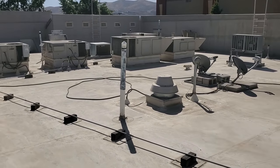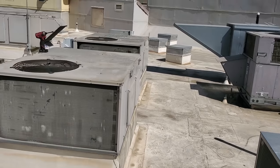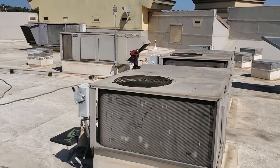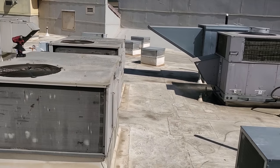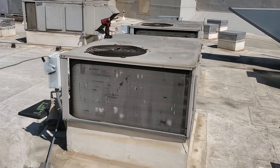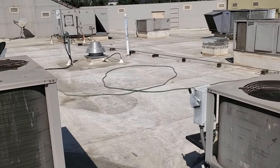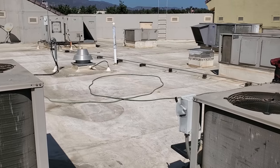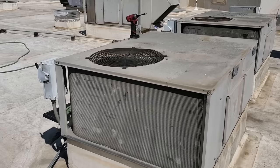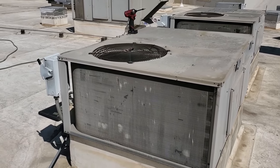I've gone to every AC and verified that the thermostats turn on every single AC, even the one that was shut off. So now that I've tested the thermostats, I can go ahead and pick each individual unit and start diving into them. The first thing I checked was that the thermostats actually worked and told the units to turn on. Once I get past that point, I can now troubleshoot the units from the unit and not worry about the thermostat calling or not, because I can jumper them out if need be. But I always want to test the thermostats first.